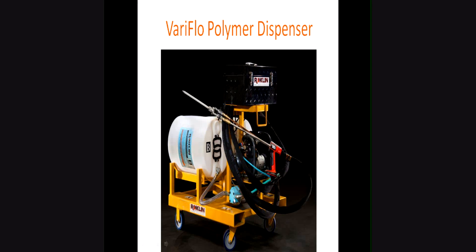We've got B-side and A-side — same setup as the other two machines. There's a toolbox where you can carry extra static mixers, extra manifold, extra motor, tubes, tools — anything you need to keep yourself in business while out in the field. The A and B-side are drawn by the pump down the tube, into the motor, pushed down the hose. This backflow control joint prevents backflow. The material goes through the valves, into the manifold, and out the static mixer — standard procedure for all of these machines.